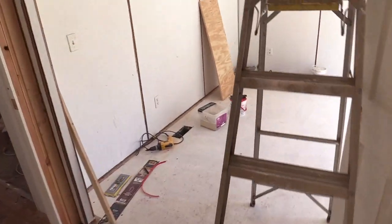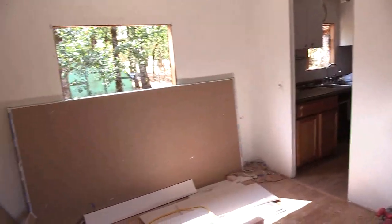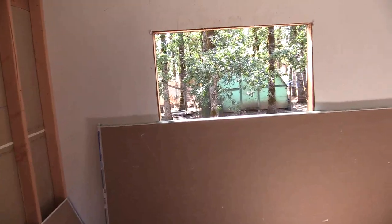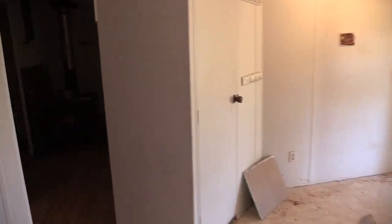Stripping the floors, stripping the walls, sheetrocking all the walls just over the paneling. The outside studs are 2x4s, regular 2x4s, but everything on the inside walls is just 1 inch by 2.5, or about 3/4 by 2.5.